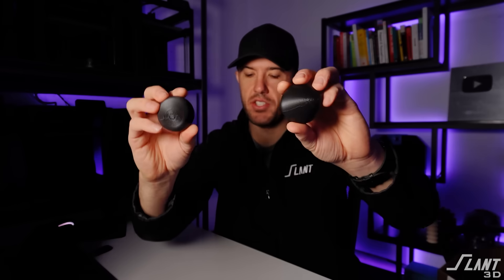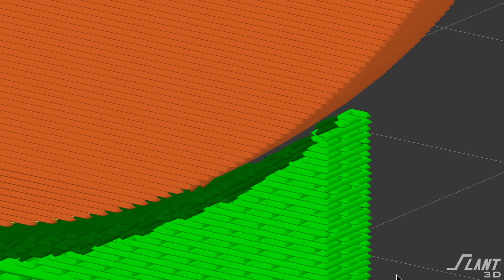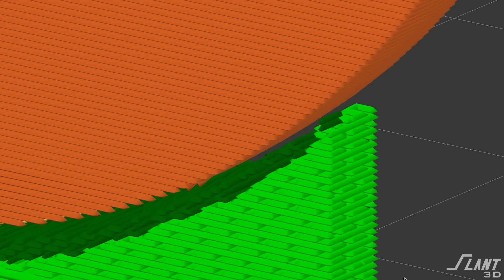Supporting the sphere really isn't quite the correct solution. You have this really flat surface that very gradually starts to accelerate, giving deformation as it transitions upward. The other issue with supported spheres is that the sphere isn't actually resting on the support — there is spacing between them. If the support is too far from the sphere, it can break loose and the sphere falls off the support and doesn't print well.